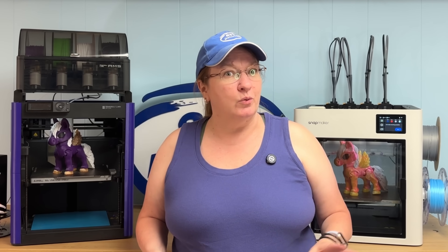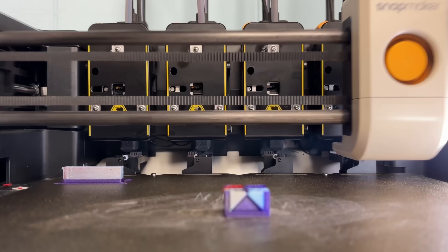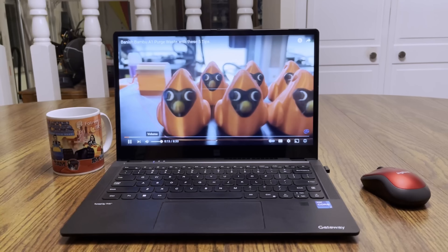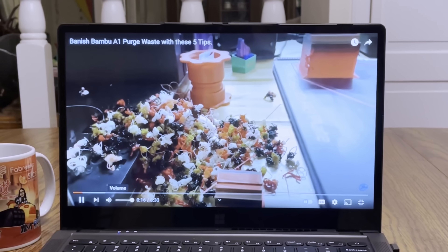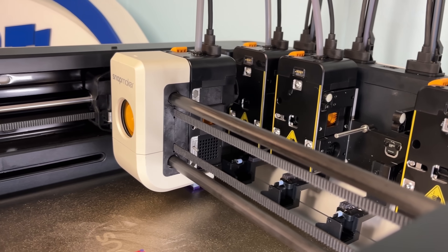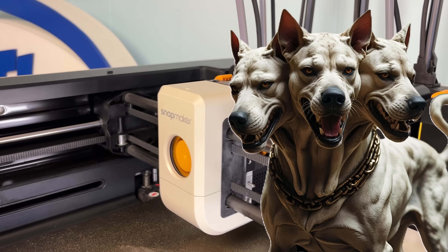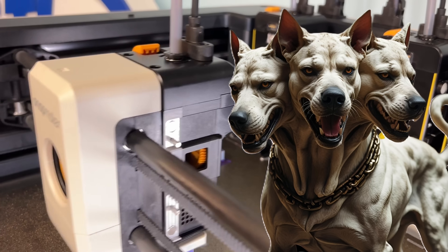Why is the Snapmaker U1 so cool? First, it's a tool changer, and that means no poop. If you've ever seen any of my previous videos, you know that I really hate printer poop. If you stick with the default settings on a traditional printer, you could end up with as much poop as you get print. On a tool changer, each spool of filament gets its own path from spindle to nozzle. When a tool head's material is not in use, it parks in the back and stays ready with the heater running. When it steps up to print, it only needs to prime the nozzle a little bit to avoid any air pockets that might have formed while it was on standby. This makes tool changers kind of expensive — basically it's a Cerberus, or Fluffy, depending on your literary background. The dog with three heads? In this case, it's a printer with four.